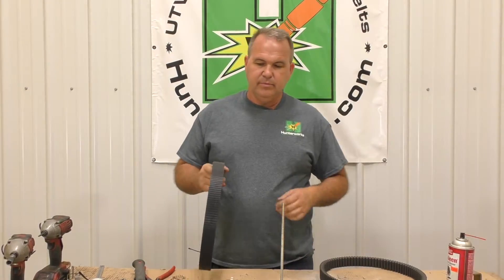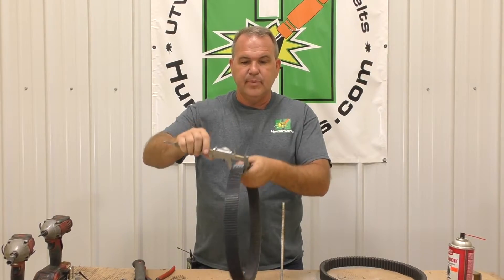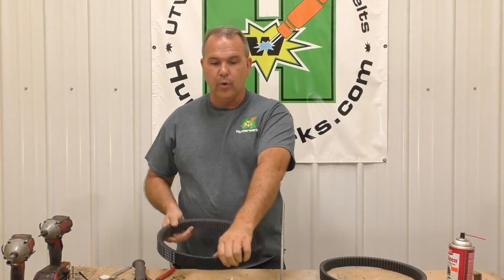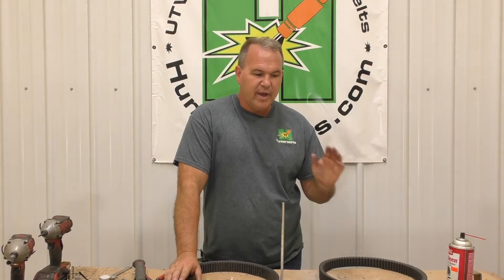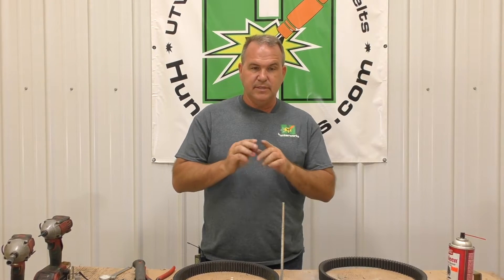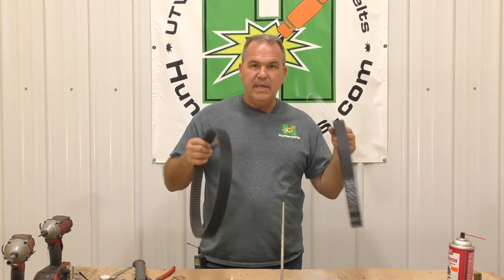The width of the belt — and FYI, you don't measure at the top; you actually measure from the inside, right up to the bottom of the cord. We're roughly about 20 thousandths of an inch wider. For those people who experience jerky starts in their new body style Ranger, this is certainly going to help because it's slightly wider, the clutch doesn't have to come as far, and it has more grip surface.